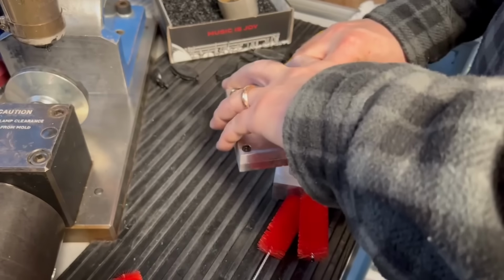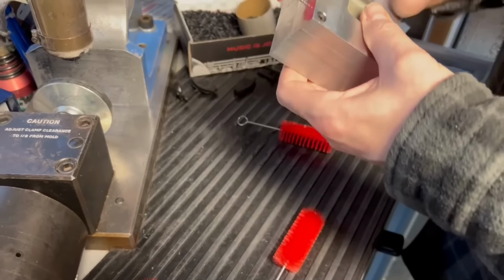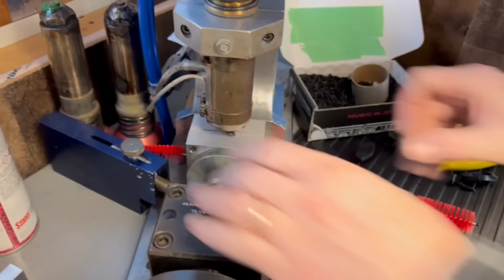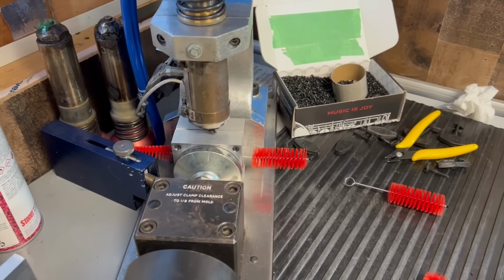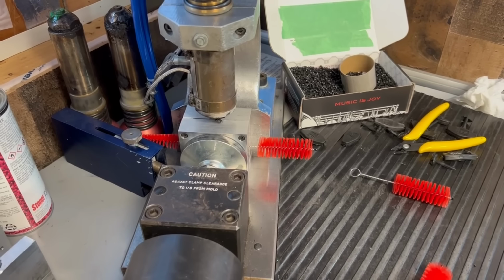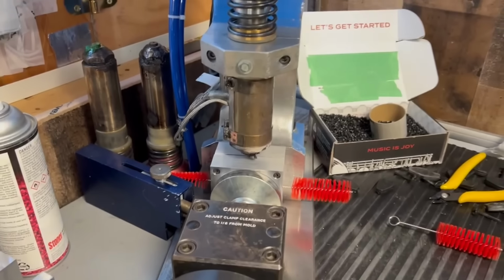Yeah, and right now we're loading so slowly. Each time it's hard to know what production would be like. But so far it seems like they're holding the details up really well. Everything is holding up. Do you want me to decrease, or actually I feel like we should increase pressure, decrease time. Okay. See if we can get that plastic fold out of there. Let's go back up to 50. We're gonna decrease down to 5 seconds.